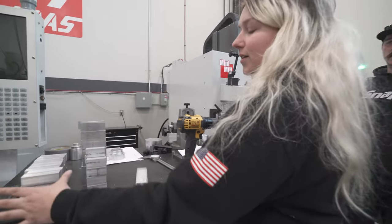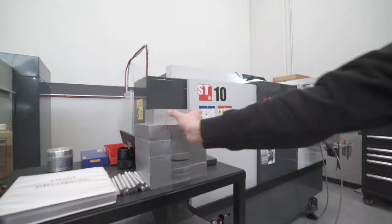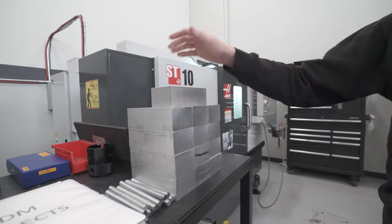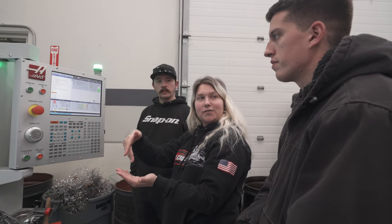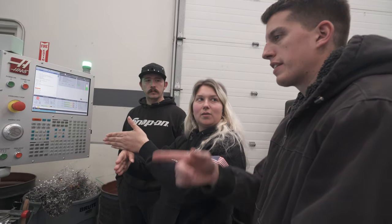We're setting up the machine to do the actual jaw that grabs the parts right now with the vices. We'll be running all of these first — all the first ops — then we'll switch up our setup and do the second op, and then move on to the next part. The center section is going to get milled down all the way through. So this is the base of the vices — we'll load that up and cut it all out. We'll take our edge finder, touch off on the back of the part, move in half the distance of the edge finder and then half the distance of our part — that's going to be our Y0. That'll make our work offset zero in the middle, and then we'll do the full length part to double-check ourselves.